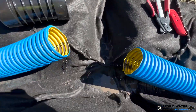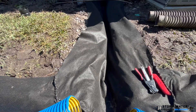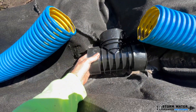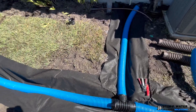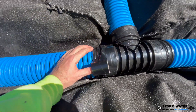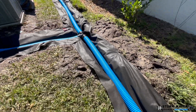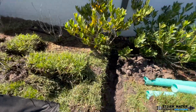To collect the water coming from the AC drip line, we're going to use a tee fitting to create a branch off of our French drain. Using a tee fitting in a French drain is okay because water is slowly rising in the trench and traveling the path of least resistance — the pipe at the bottom. You want to use a Y fitting anytime water is going to have head pressure, like a gutter downspout drain, catch basin, or channel drain where water moves quickly and could carry debris. Our French drain is an enclosed system with no debris, so a tee fitting is fine for this application.